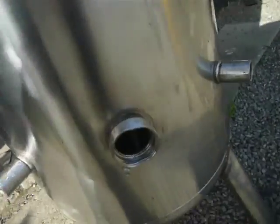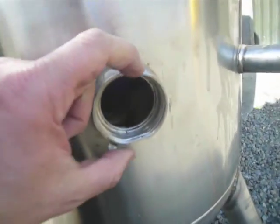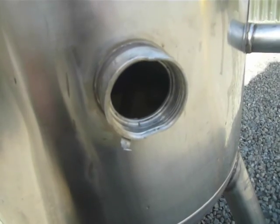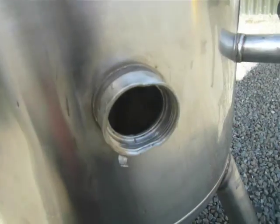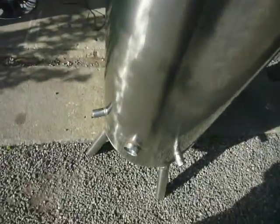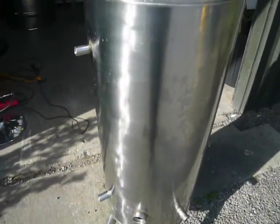I'm assuming that's why that ferule has been smacked over. I originally thought it would have just been damage from demolition guys ripping this out of a building because they're pretty brutal. But I think the plumbers actually smacked these at the top and bottom of that ferule so it can't be used as a hot water cylinder again under pressure, because of the failing around the top. He probably just did that to stop someone salvaging and retasking it — like I've done.